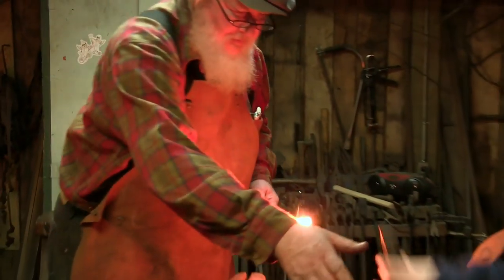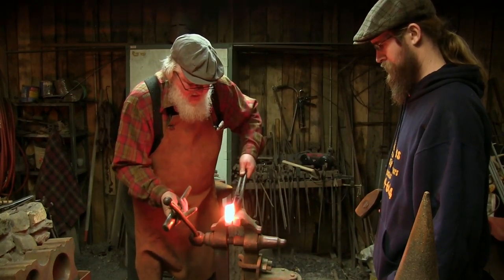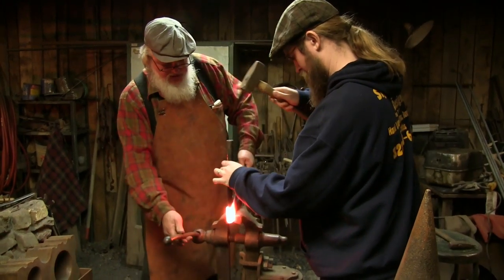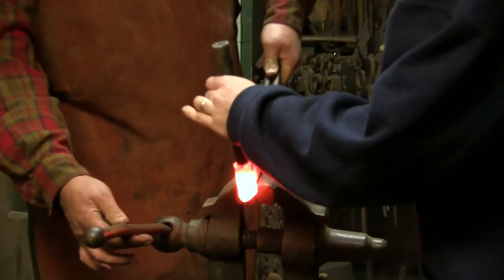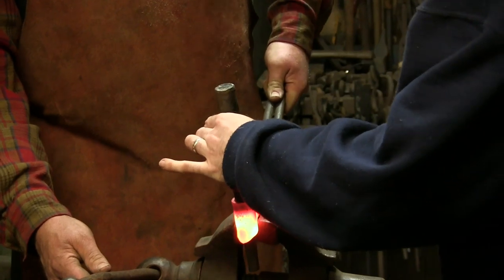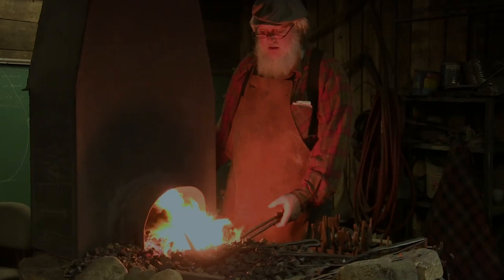To use this drift, you can see it's kind of teardrop shaped. You want to put the sharp edge towards the front and just start driving it through until you can get the whole thing driven all the way through. It usually takes more than one heat to do this. The way this drift is made, it's tapered at both ends so that the widest point is where the widest point of the handle is going to be. So when you drive it to where it pops all the way through, you're done.